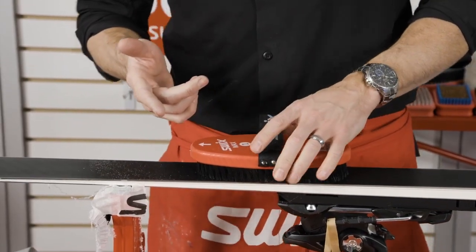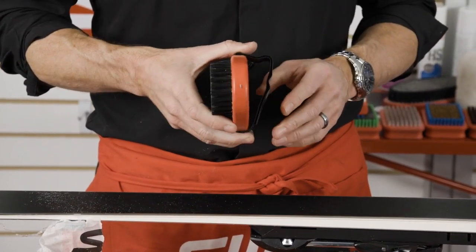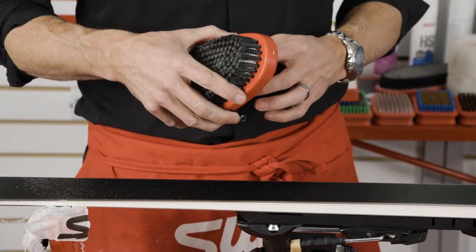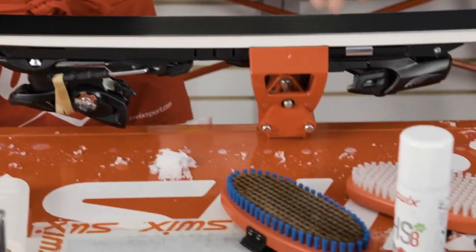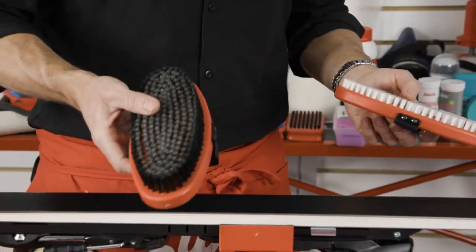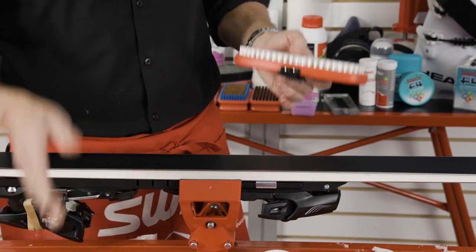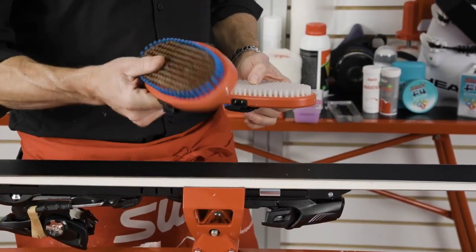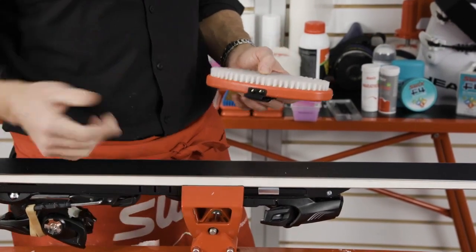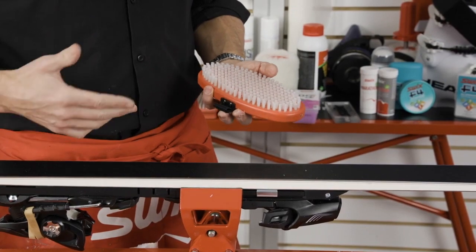And the second part of the question was how many cleaning passes I do with the last white nylon brush. I'll go through the progression. I keep everything pretty similar. I use this steel brush first and do 6 passes per section. I do 6 passes per section as well with the brass brush, and then with the nylon I'll do the same thing.